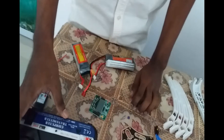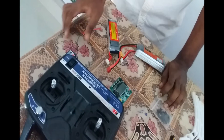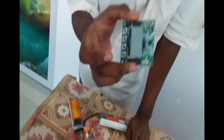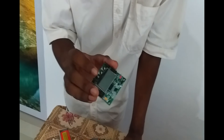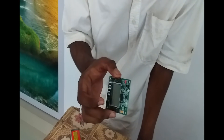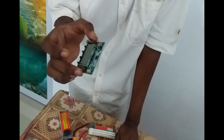In this drone we are using a 6-channel transmitter. This model is the FS-CT6B and it works on 2.4 GHz. This is the required receiver for this transmitter. And this is the motherboard of this drone — the flight controller — which comes with everything like self-leveling. Everything will be handled in the flight controller only. If you want more details, you can find the link to that flight controller in the description.